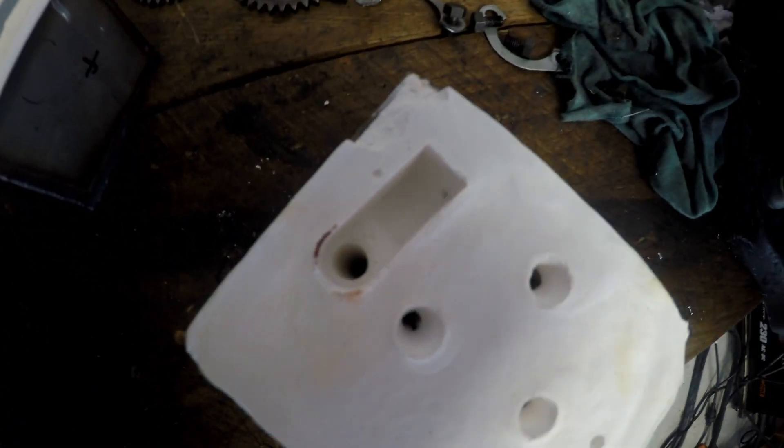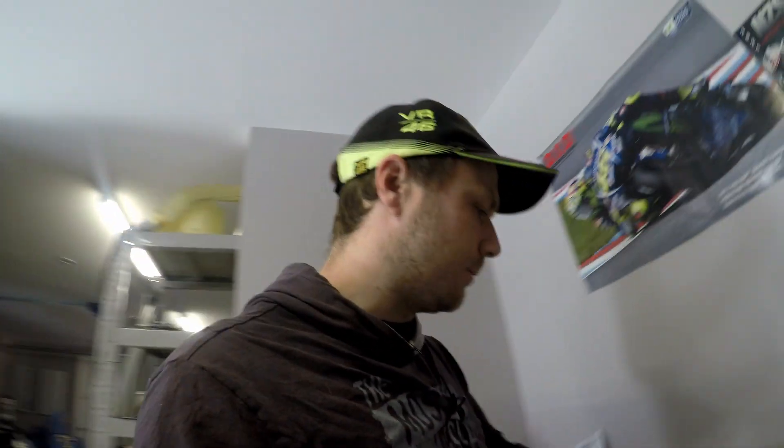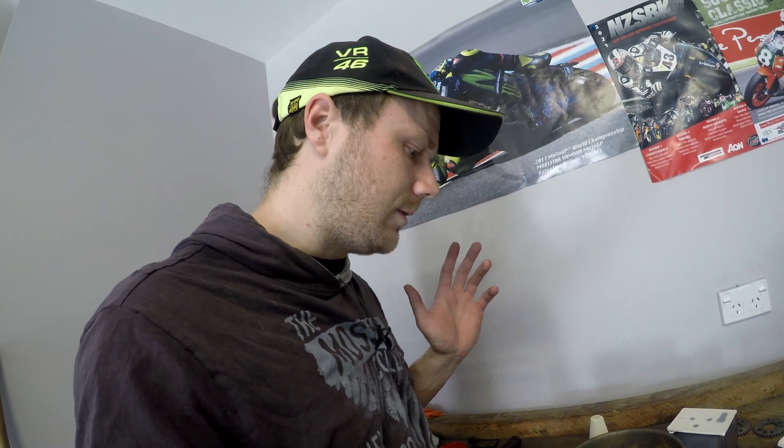A couple days later I've finished the burnout cycle on this mold — it used to look like that, now it's like this, and it worked really well, it's nice and empty. I did have a bit of a mishap — I burned all the hairs off one of my hands by accident. My kiln has two vents and I had them closed at about 400 degrees, opened the lid, and a couple seconds later a giant fireball came out. When I did the next cycles I had the vents open and there were no more fireballs. On the last burnout cycle I took it up to 900 degrees and that seemed to burn everything out perfectly. Now we've got to get on to making the furnace to melt the aluminium.